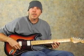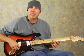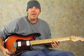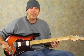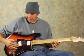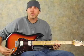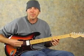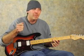They all carry it. What this potentiometer does, as a variable resistor, is basically allow you to limit the amount of output coming out of your guitar, the amount of signal that's going to the amp. So it's sending all or part of your signal to ground. So you're either getting less or more signal depending on how you vary it, okay?